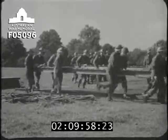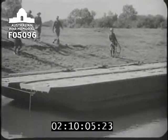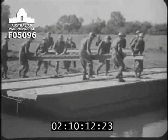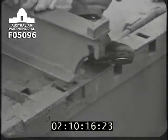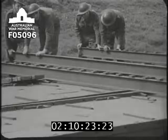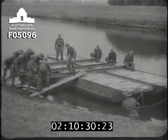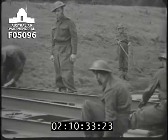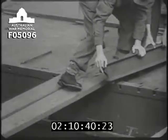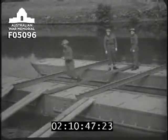All spare men fall in ready to be detailed for other jobs — this should be done automatically. Each road bearer is a four-man load. Dowels on the ends are fitted into slots along the gunnel of the offshore pier — the two button road bearers into the outside slots, the plain one into the middle. When that's done, one man sits on the end of each road bearer to keep it down, and the remaining three go ashore, erecting the stiffening catches as they go. The stiffening catches keep the raft square during building. The three men on the shore end of each road bearer now lift and push out together until the inshore dowels of the road bearers drop into their slots in the inshore gunnel. The plain road bearer is then turned over on its flat so that it can be used as a bridge along which the remaining road bearers can be slid.